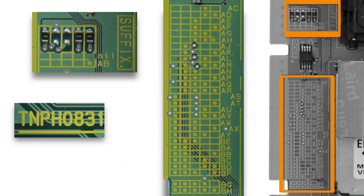The suffix code is determined by looking at the arrangement of resistors and the suffix grid. Each resistor is represented by a dot on the suffix grid. Find the arrangement of dots that match the arrangement of resistors. The letter or letters next to this line on the suffix grid is your suffix code.